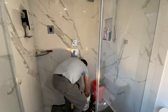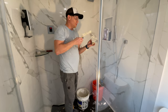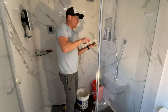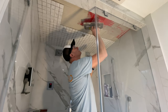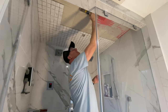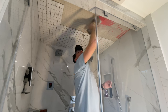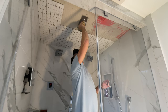When you put mortar on the ceiling, you don't put the mortar on the ceiling first — you put it on the actual tool. I always forget to do that, and then I realize I really don't tile many ceilings. When you put it on the mortar tool first, it goes on way easier and it doesn't spill. If you take anything out of this video, when you're doing ceilings, take that tip because you'll have a way less messy install.